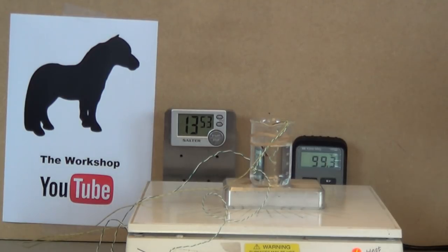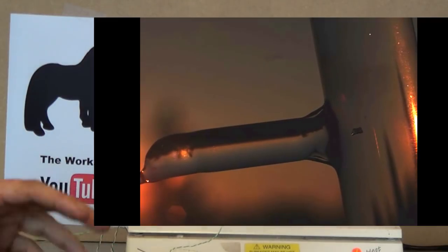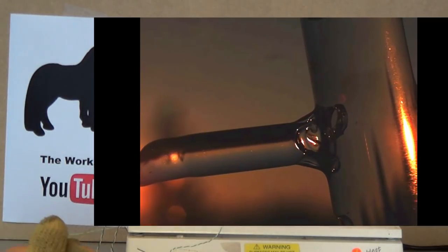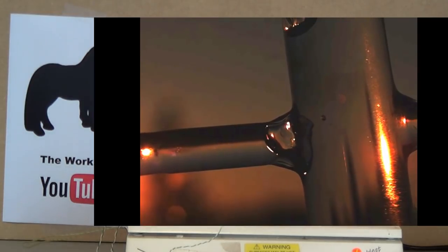The cavitation that happens inside diesel engines is not the same thing — that's void cavitation, the same as a propeller or impeller, or what happens in your forks and suspension. It's basically pulling a liquid apart so quickly that voids literally appear. When those voids collapse — because they're a perfect vacuum — all the atoms around that sphere of nothingness collapse inward, and the energy of that collapsing is so intense you can even see light being produced from it.